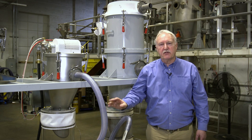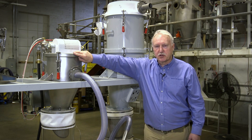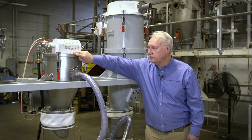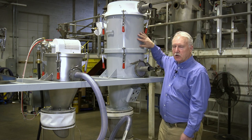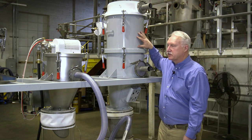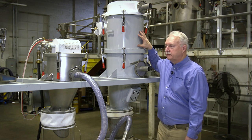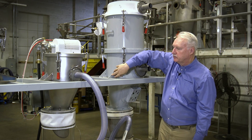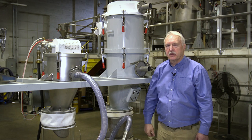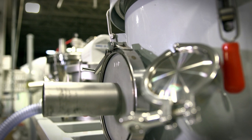The Signature Series, even though it is pre-engineered, is available with different filter options. We have a UniFilter which is for less dusty materials and lower rates, and a cartridge filter designed for powders with higher dust content and higher rates. Both filters are washable and removable without tools. They can be mounted on support ears, on their flanges, or from above with a support frame.